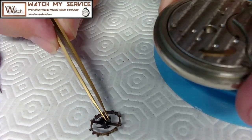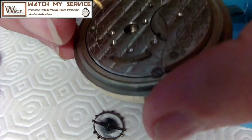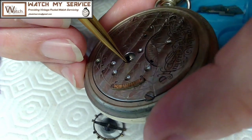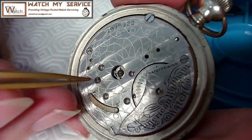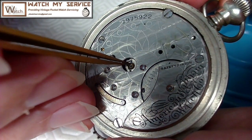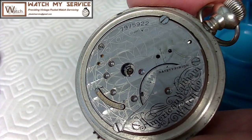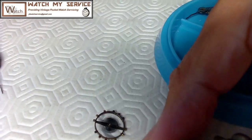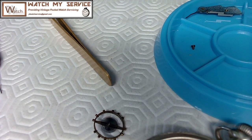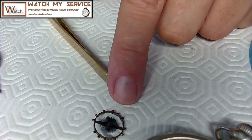I'm going to tap inside the hole and see if the balance ticks back and forth — yes it does. You tap inside here and it snaps over because there's power on the mainspring. Power on the mainspring is absolutely a good thing. Now I'm going to take the hairspring off of this balance.